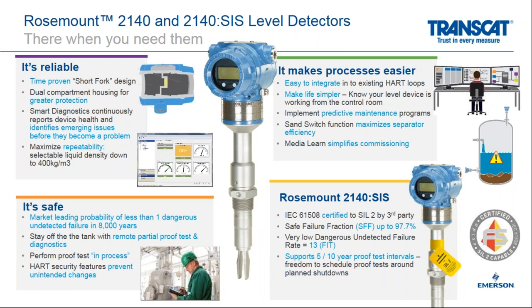Sure. Okay. What is the liftoff voltage of the 2140? Great question. We designed the liftoff voltage to be as low as 12 volts, and that's actually posted in our specifications. But we've actually had it power up in laboratory settings down to as low as 8 volts and function flawlessly. So we've put a margin of error in there, and we list the minimum voltage requirement as 12 volts DC.